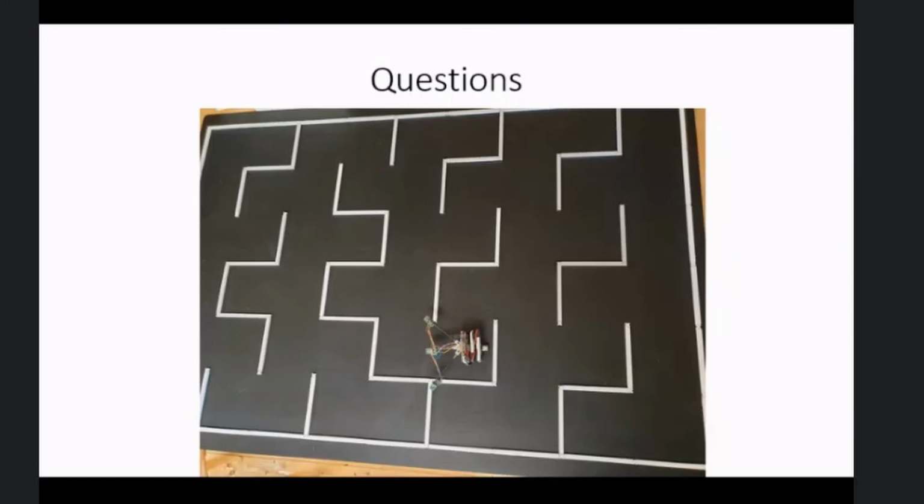walls. For me, the biggest problem with a purely printed maze is for the judges. How do you tell whether the wheels have run over a wall? But yeah, my question is about finding. Fast running mice make a decision before they've even got in the cell because they can see the wall ahead. So with the slightly raised walls, you could potentially do that. I guess even with a printed wall, maybe you could do it. It might be a bit more tricky with cheap, simple sensors.